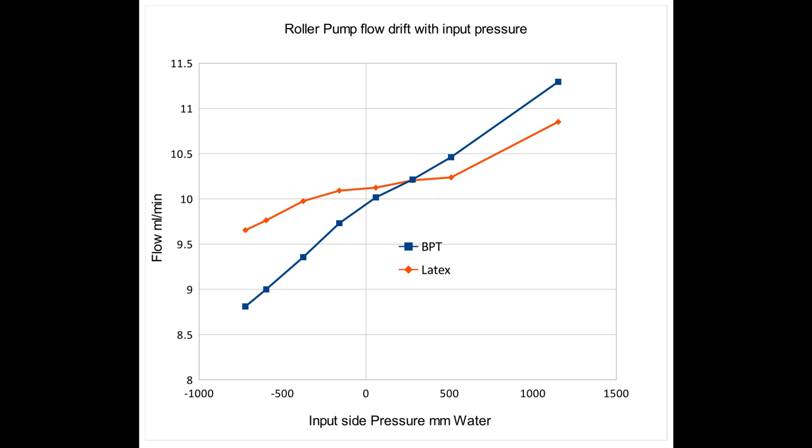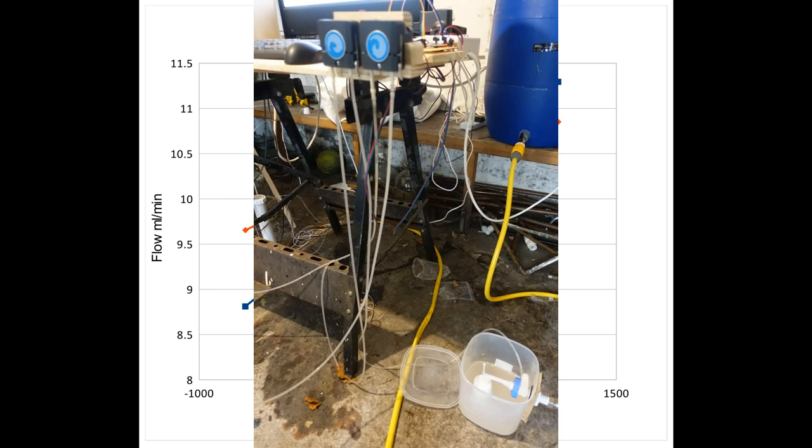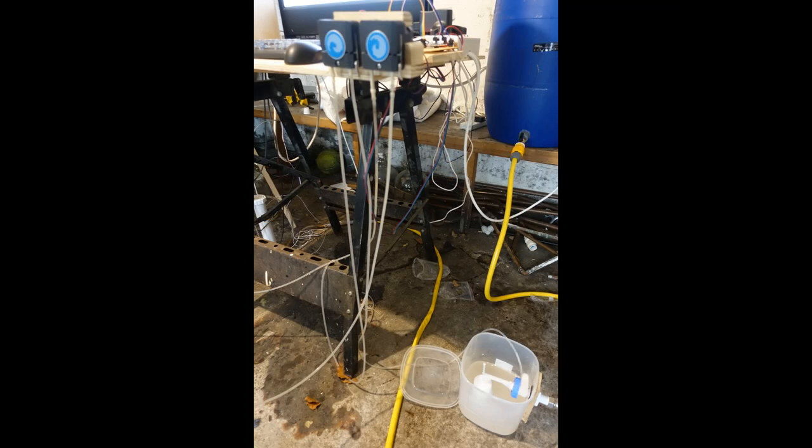If you're drawing wash out of a barrel it's probably at least 50cm deep, so you can expect a 5% flow rate change from full to empty from pressure alone, which is too much. That's why I use these float valve chambers to keep the pressure on the inlet side of the pump constant, irrespective of the height of wash in the barrel. But if you do that, you're already three quarters of the way to making a gravity feed system — so why not use that instead? Why not indeed?